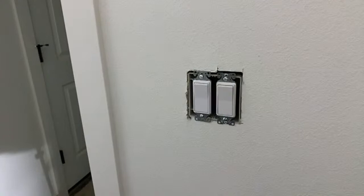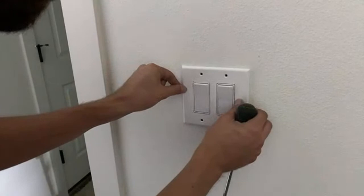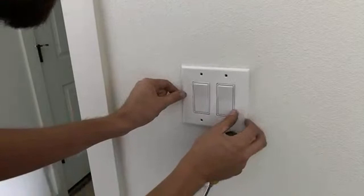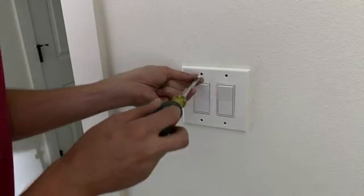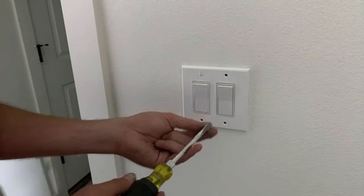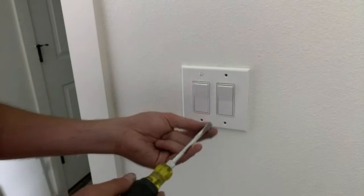I just lost all my screws. Put the plate on here real quick. There's a hair of sheetrock - try to get it as flat as possible. A lot of people don't do that - when they go to put in their devices and trim, they just put the plate on with all the crusties over the sheetrock and that raises your plates. Not good - don't be lazy, do it right.